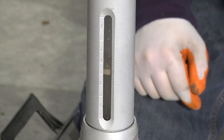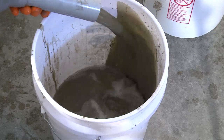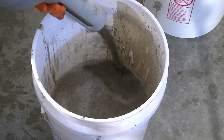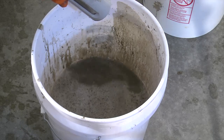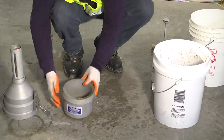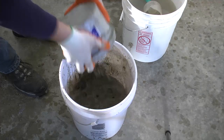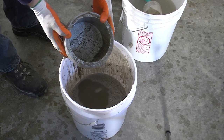In this case, the air is stabilized at 5%. The second meter reading was identical to the first, so we're going to record this as the final meter reading. The next step is to disassemble the meter, dump out the contents of the measuring bowl, and examine the measuring bowl for portions of undisturbed, tightly packed concrete. If such material is present, the test is invalid.